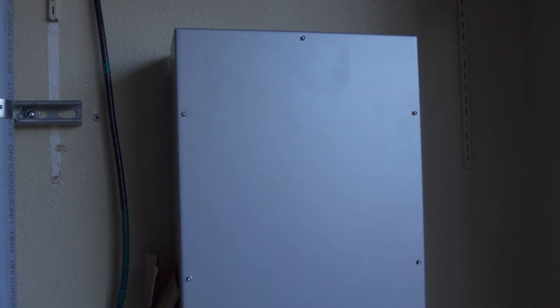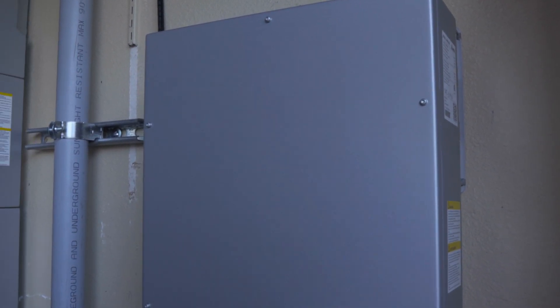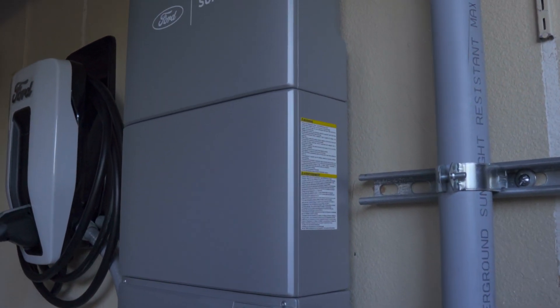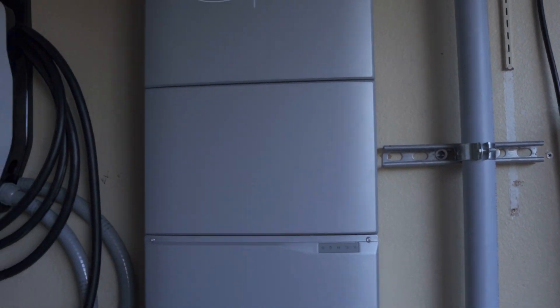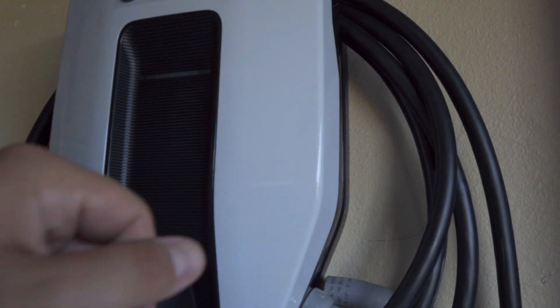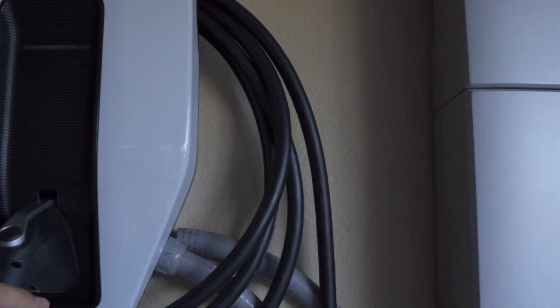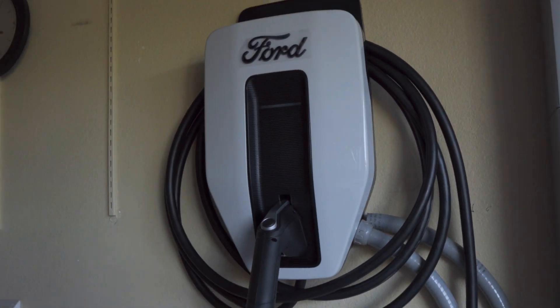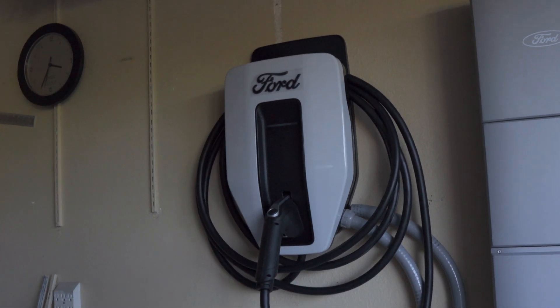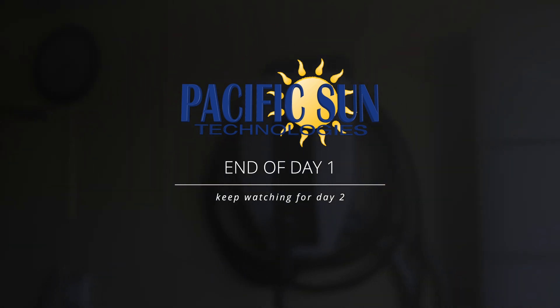You have the transfer switch over here, which is really basic. I'm not super impressed with it - it's simple and a little dated in my opinion. But the Delta equipment is nice, I have to admit. The charger is made by Wallbox. My one gripe is it's very cheap - it's just plastic. Mounting it on the wall bracket, that's plastic too, and you've got to be really careful. This is a heavy cable because it's carrying 80 amps, which is thicker than a normal cable. It's a lot of weight and it just feels cheap for what it is. I feel Ford could have done something a little more premium.